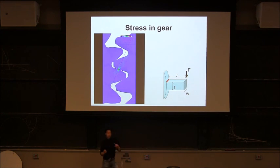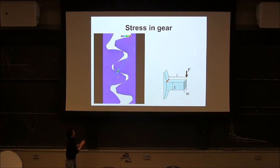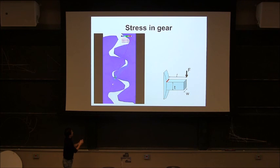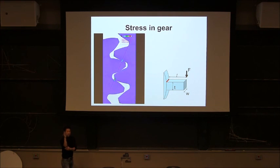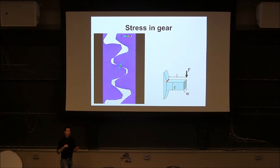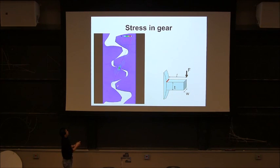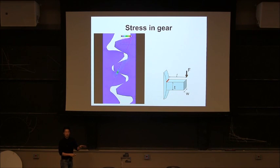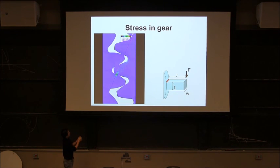The average force on gear teeth is going to be aligned with the pressure angle line of action. In reality it fluctuates slightly due to friction, but averaging out, because these gears are moving pretty fast, the actual force on the shaft will be exactly aligned with the pressure angle. The shaft will feel not only torque but also the separation force.